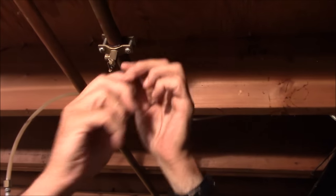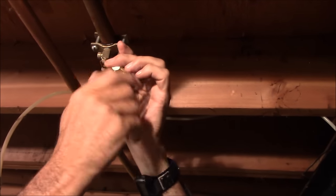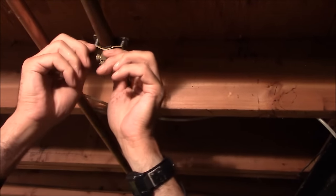This particular valve was installed on the cold water line. When I advise my customers about this job, I put the valve on the hot water and I put it as near as possible to the hot water tank, because the humidifier is not drawing tons of water. So if you put it on a hot water line too far away from the hot water tank, by the time it gets here, the little bit that the humidifier is calling for won't be hot. You're best off right at the hot water tank — the closer the better.